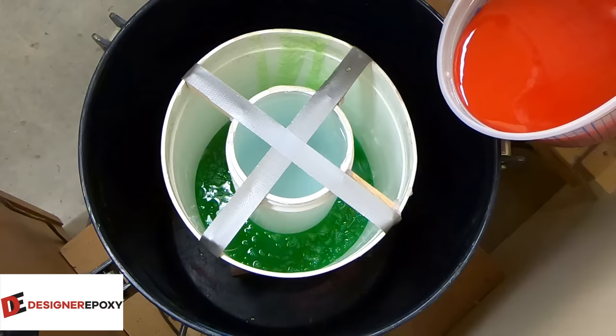While I'm never a fan of putting water in castings like this, because there's a lot of things that could go wrong, this was suggested in the comments a number of times over the last couple years anyway, and this piece did not thermal crack. So when I did take it out, the water was actually warm, so it did act as a heat sink, and I can't say for sure that it prevented this from thermal cracking, but it didn't, so you've got to give it credit. Thanks for the suggestions. There, that was easy.